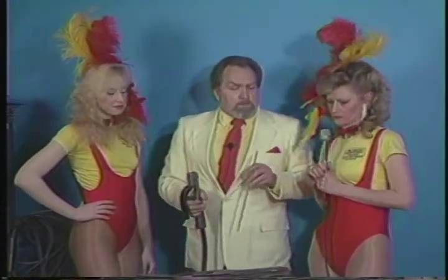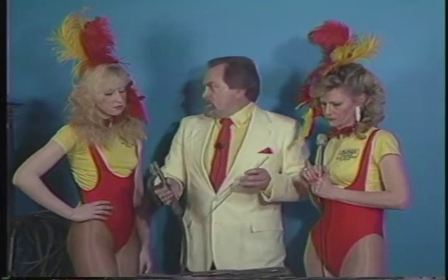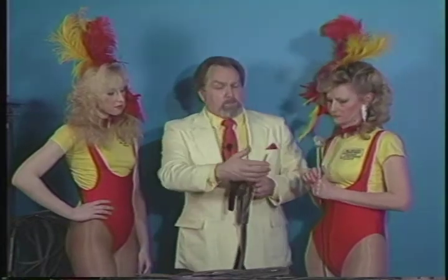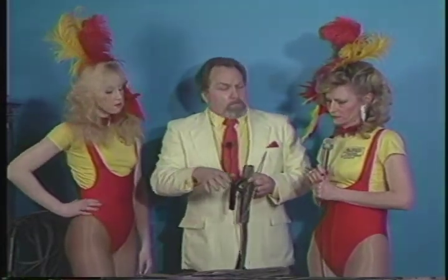Stick welding, as a matter of fact, Chuck is a person that works in a grinding shop, and they recently needed something where they had to have hard surfacing put on it, so it could be ground afterwards, and they wanted to end up with a hard surface for wear purposes. Another example is where you use stick welding a lot: a steam shovel, with a scoop, a bucket, and all those claws at the end. Very often welders will go in there with hard surfacing rod. That's a real popular way of doing hard surfacing.